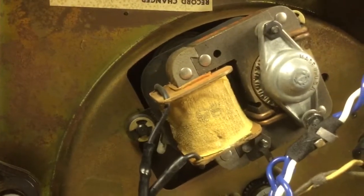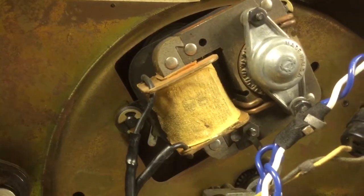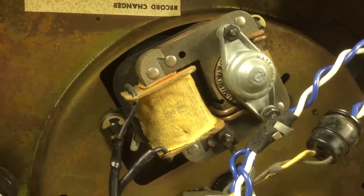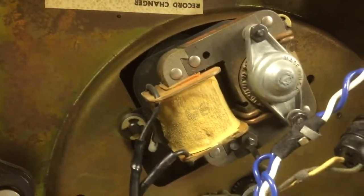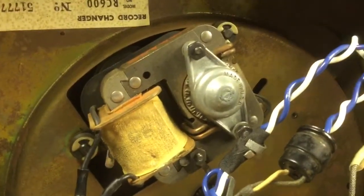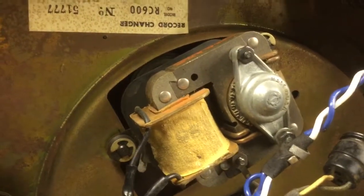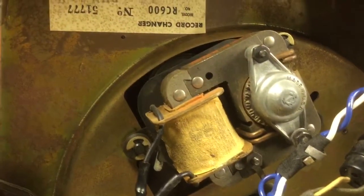And I kind of question whether it's what it's supposed to be there for, because with a strobe on the turntable, it's running faster than 78.26 RPM, which was the strobe speed with a gear reduction. So I might try taking that spring off. It'll make the motor shaft where the idler contacts it a little bit smaller in diameter, but it will get rid of that tick, and we might get closer to the actual speed that it's supposed to run.